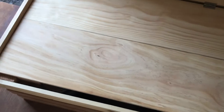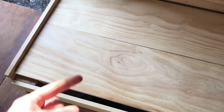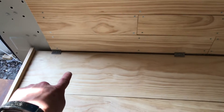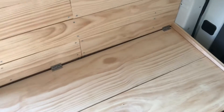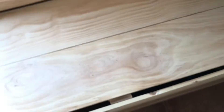It's all connected together. I ended up putting the screws on the other side — I got 2-inch screws, so they were long enough to connect everything but not so long they're poking out. Now I need to attach the hinges to the wall again. I forgot to get those screws out from under there. I'll test to see, now that it's more than double the weight — before it was just one piece, now it's two pieces and the 2x4s. If it ends up screwing up the walls like it did on that middle one, I'll just get bigger hinges. They had some big ones at Lowe's, but I was hoping to get away with these little ones because I think they look nicer for an indoor situation.